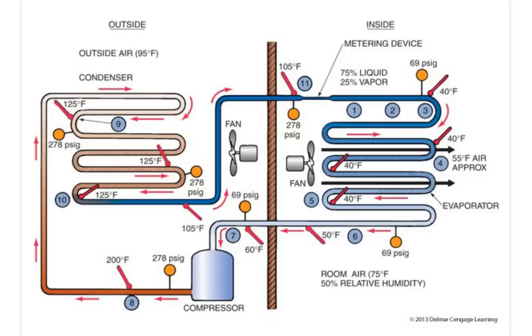This is the video diagram that Travis was referring to. Right here we have 278 PSIG and 200 degrees Fahrenheit of temperature on the refrigeration line leaving the compressor, and we only had 20 degrees of subcooling. Just to give a little reference: on this diagram, this is the wall of a home, this is the indoor unit air handler and evaporator coil, and this is the outdoor condensing unit. Let's break this down so it's a little bit more clear.